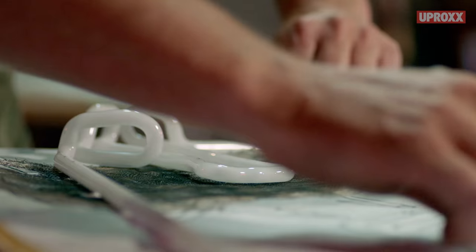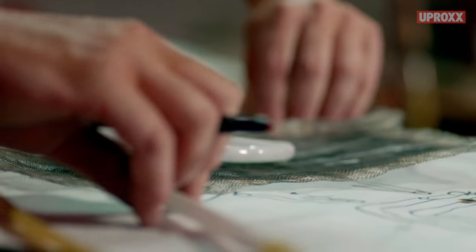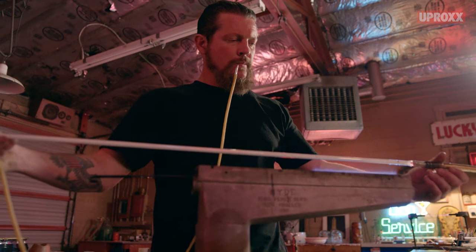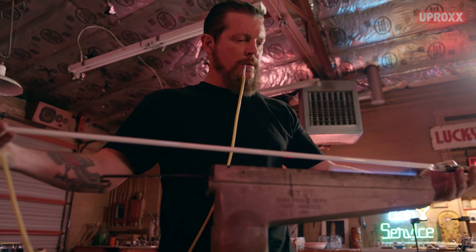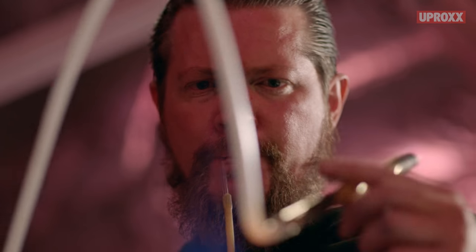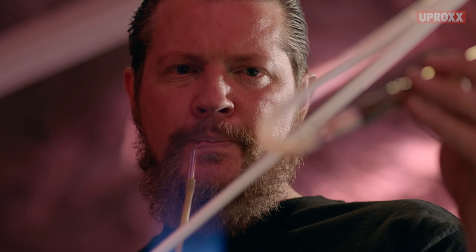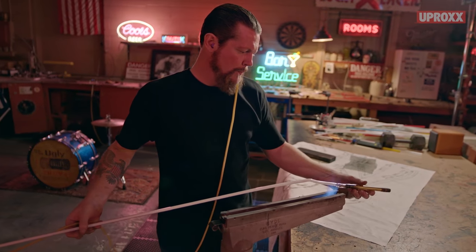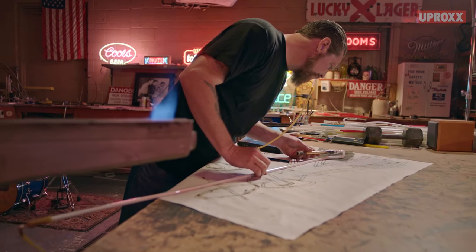I use my sensibility to actually see what the glass is doing more often than what the pattern is doing. I can see that it's not right if the pattern is crooked, so I adjust it accordingly. It can be a signature, it can be lettering — it's really amazing how much you can do with it. When you have molten glass and you're trying to bend it, you need to inflate it. That's the first question people ask: why is there a tube in your mouth? If the neon collapses on itself, it's garbage and you have to start over. It's one bend at a time — that's the most amazing part about neon.